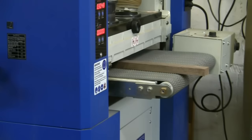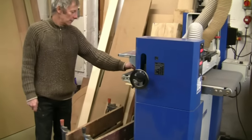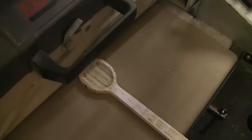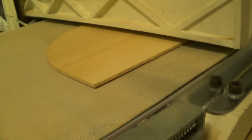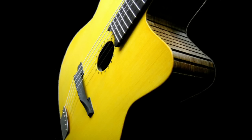This is one of those machines which the longer you own it the more versatile it becomes — you get to know its feed rates and what combination of grits work for different species of timber. I'll second that Andy. Although my machine is smaller, it achieves exactly the same precision and is incredibly versatile. I started off using mine for thicknessing guitar tops — any luthier watching will know you've got to reduce the spruce top to between three and four millimetres. In the old days you did it with a hand plane and scraper, and this is an absolute joy to use.